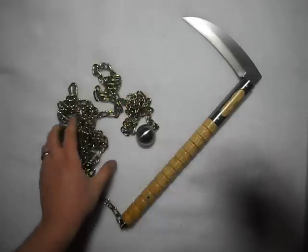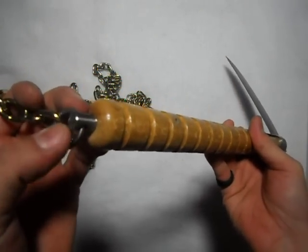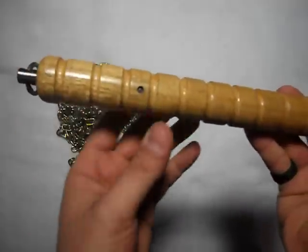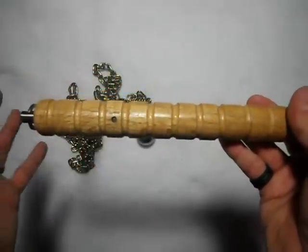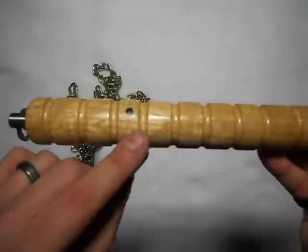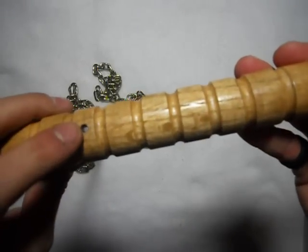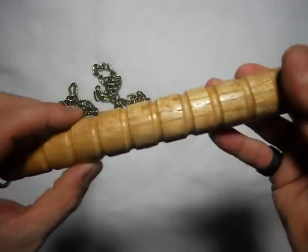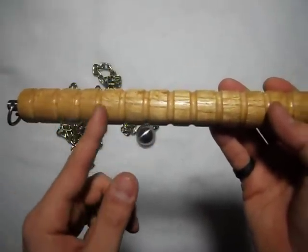The handle is a solid oak handle. A hole has been drilled with a 3/8-inch solid steel pin connecting the chain; it goes all the way up to about here. It is glued in there — I use glue just to temporarily hold things so nothing twists or moves while drilling, kind of like a temporary clamp. It is pinned with a four-millimeter hardened steel pin, recessed a little bit below the surface of the wood. The solid oak handle has about quarter-inch ribs turned into it.